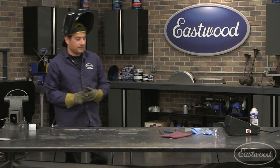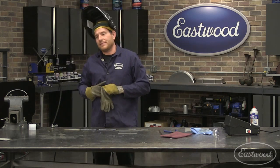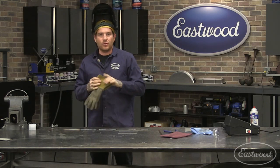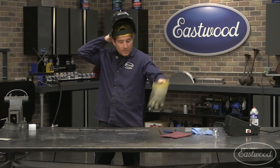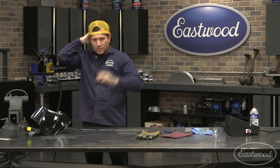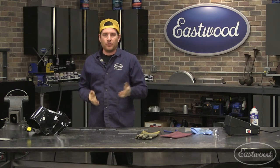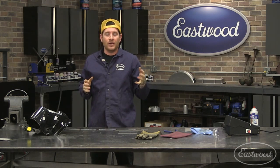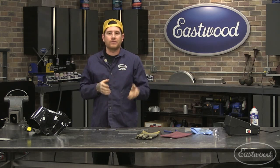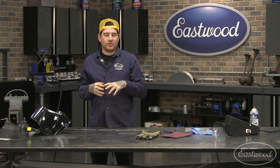when you're welding on thinner stuff, sheet metal and that kind of material, you want to try and keep the filler rod about the same as the parent metal. So if you're looking to do automotive sheet metal work, if you're welding on like 20 gauge steel, you want to keep your filler rod right around 030, 035 because it's going to be really close to the parent material, because you want it to melt at the same time.